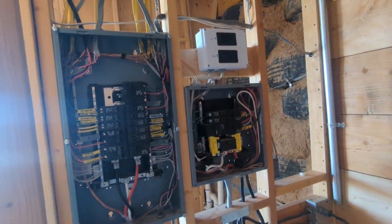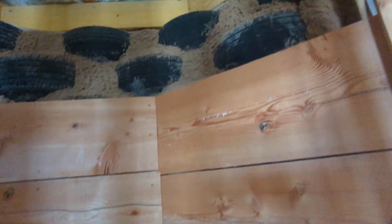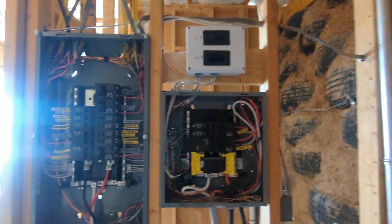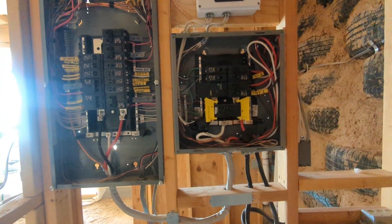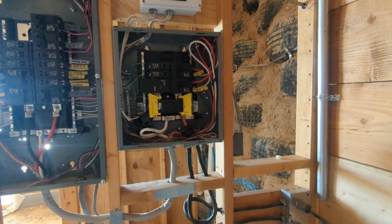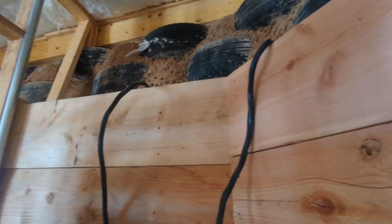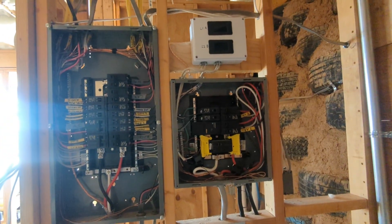This is an electrical room. There is a wall for an inverter, another inverter, and maybe a battery. There is a ledge where you can put stuff on top and I will have wall batteries below. I split the incoming power from the outgoing power. So here we have incoming power and two inverters — that's just to have a backup. I have 2x60 amp wire going in there, so I can have 2x12 kilowatt, which is overkill. But I can choose to install smaller inverters too, like 2x6 for example, then you have some redundancy, which is nice if you're off grid.